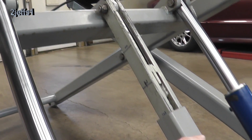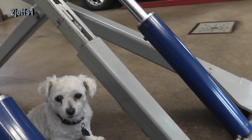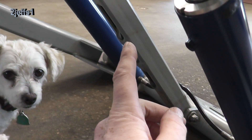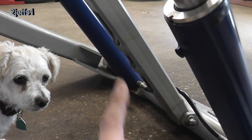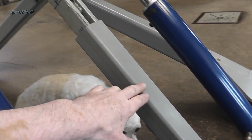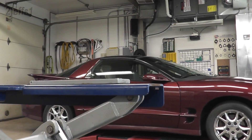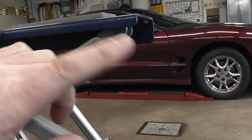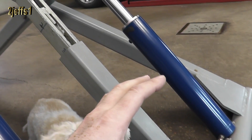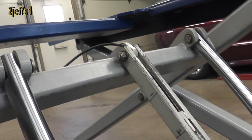This piece here is a safety lock in case the hydraulics ever fail, so the car doesn't come down on you. Originally they only had two positions — I added one more. The problem was, if you had a van on here, to get it to release you had to go all the way up, then a finger inside would flip over allowing you to bring it back down to ground level. So I made some changes — let me give you a better look at them.